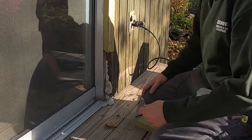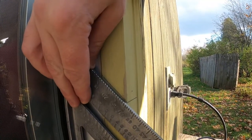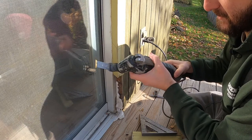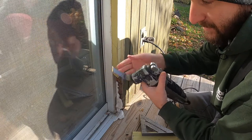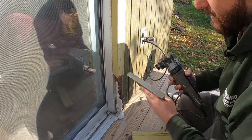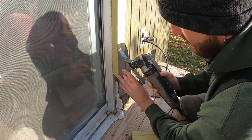To mark this I used my little square and made a mark, then used a speed square to make the 45-degree angle. Now I'm going to use my multi-tool — I'll put a link in the description. This is a Rockwell Sonic Crafter, but there are a bunch of different companies that make these; you can get them for about a hundred bucks with blades and everything. It's really hard to make that cut, so here's a little trick: I use my speed square to get the angle set perfectly to 45 degrees when I get it started, so I know I'm going to go straight in.